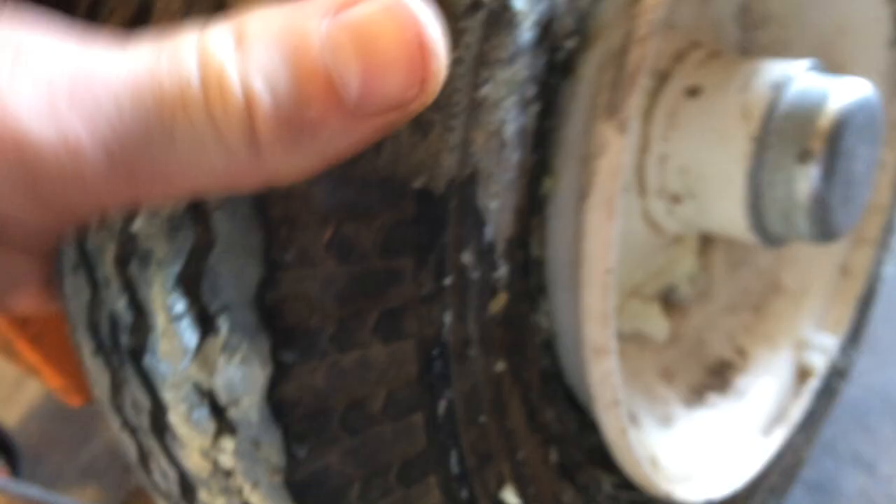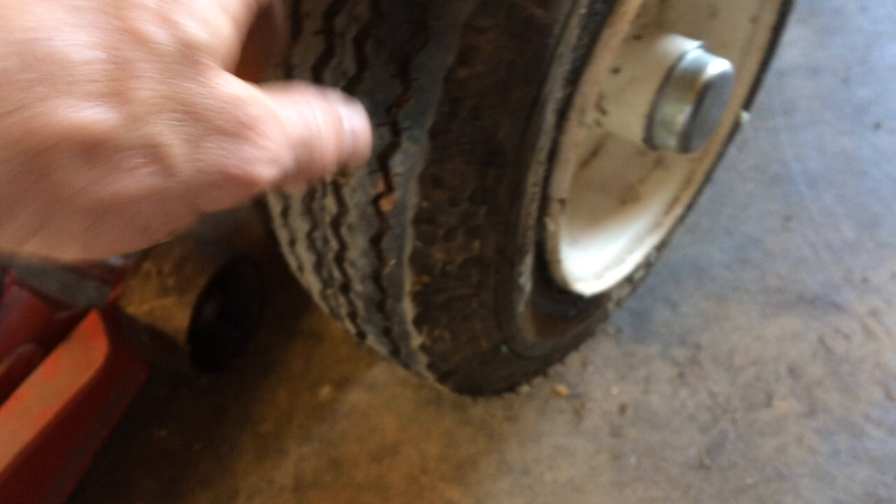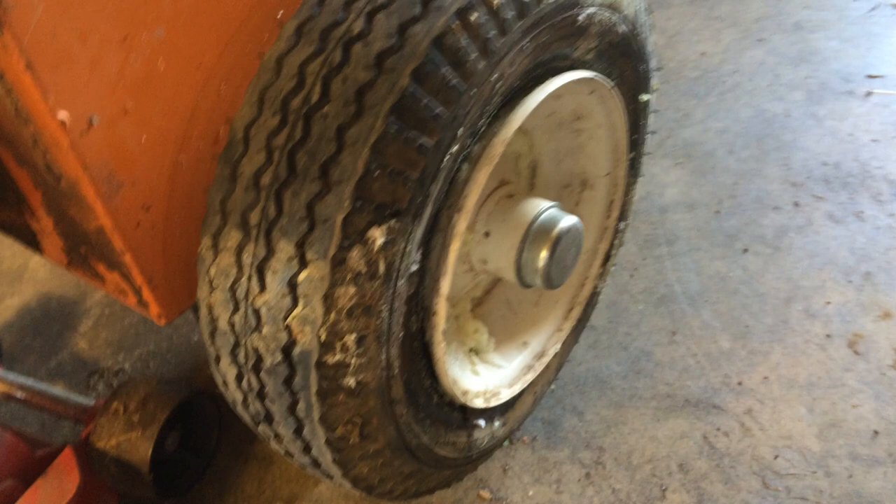Just towing it to the garage — this thing is destroyed, it's no longer hard. Interestingly, when I look inside, the foam is not fully cured. So I'm going to try one more last hurrah. I'm going to drill three holes, pump a third of a can into each hole, seal those holes up, and hope the expansion pressure pushes it back on the bead. I'm going to let it sit for a week — I don't need this thing any time soon. Move it to the other side so it has less load; we'll give it every chance and get to the bottom of this flat-free tire issue.